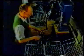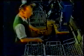Often gudgeon pins have to wait several days before testing and assembly. Let's have a look at the pin which we put on one side. After one day it looks much the same, but magnified 400 times, rust is clearly seen to be forming. After a week, rust has taken a firm hold and is clearly visible to the naked eye. This pin will be scrapped.